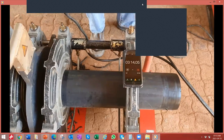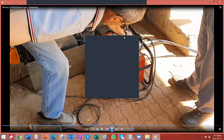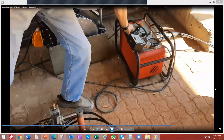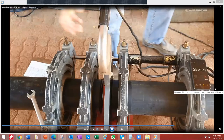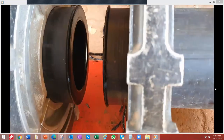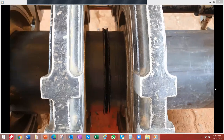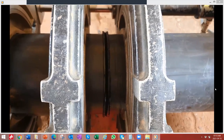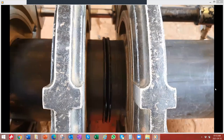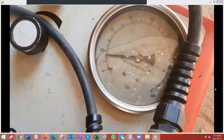As we approach the 3 minute 10 mark, we are now getting ready to remove the element. The pressure is released on the hydraulic pipe and the element is removed. There is a good bead formed and the surfaces are perfectly flat. We increase the pressure and now have 11 seconds to take it up to maximum pressure. You can see as the pressure is applied how the bead pushes out. Once we're up to pressure, we lock the machine to ensure that we have a pressure of 16.6 bar.